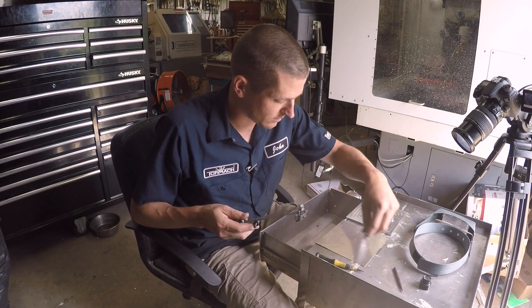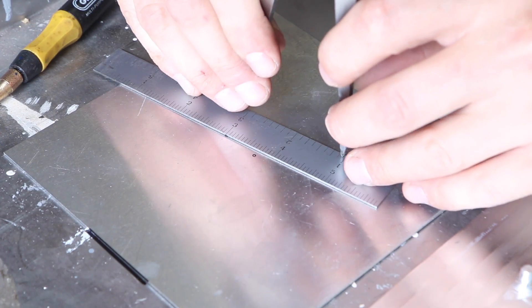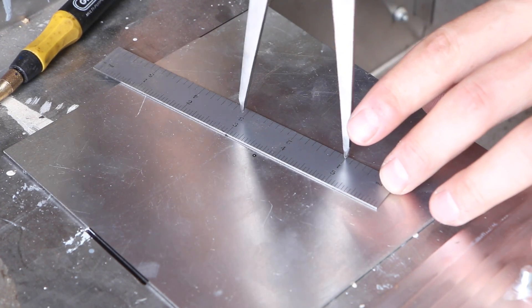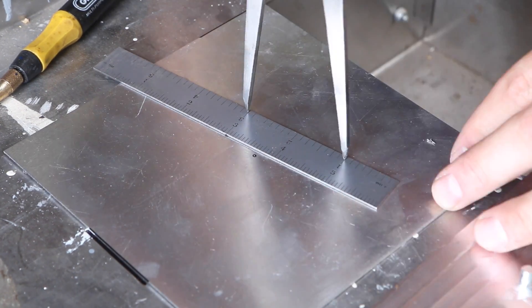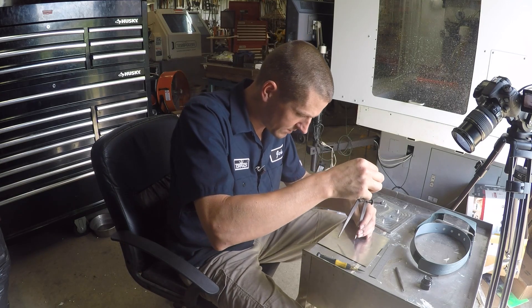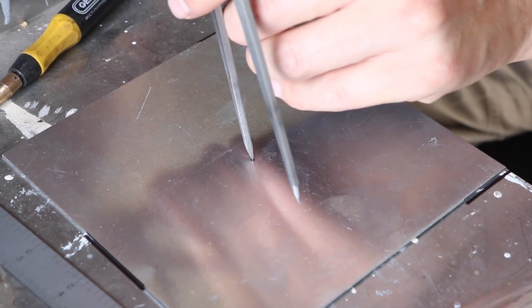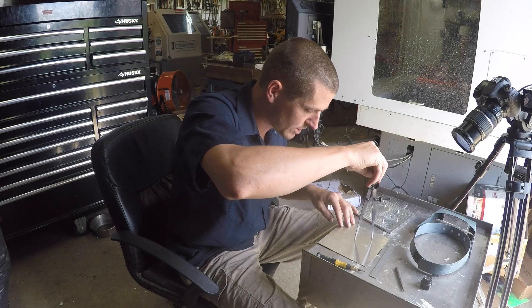Let's check our setting. I'm trying to keep the camera focused — I'll leave the plate in the same position. We're definitely not in the groove right now; we're too wide. Okay, I'm comfortable with that now. Dividers are set, we've got our center point. We're in there — now hold the top, try to keep them straight up. The more you bend them down, the more you're going to change the radius.